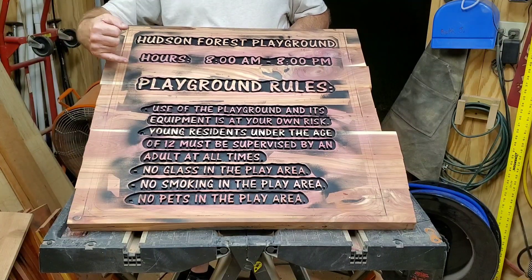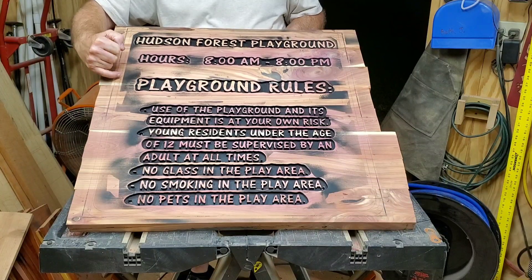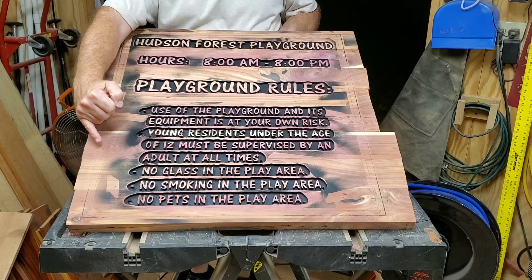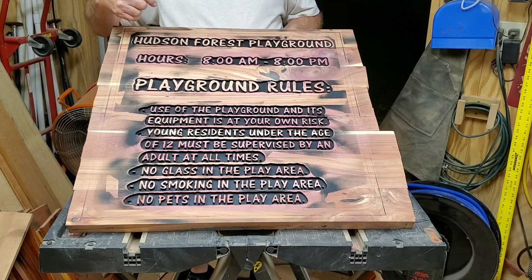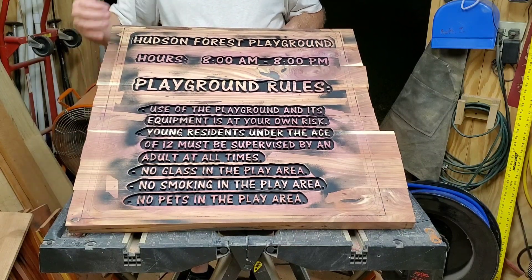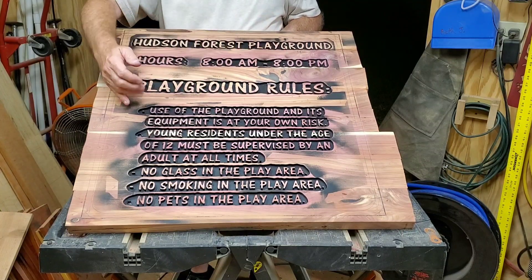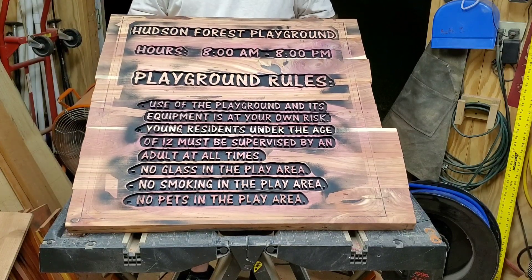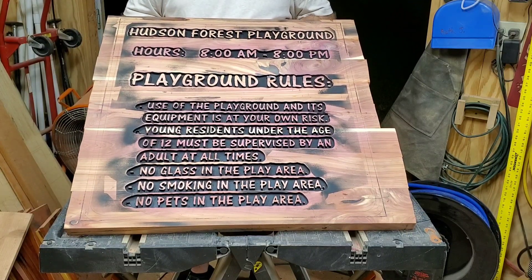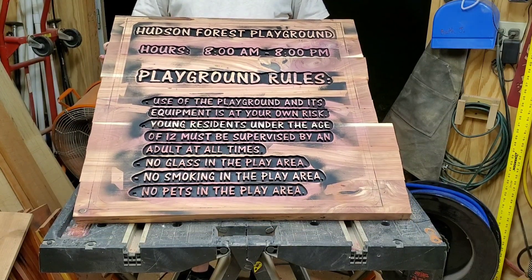Tomorrow afternoon I will start clearing out the background. What I'm going to do is come in along this inside line all the way around — I've got to cut about an eighth inch deep and about a quarter inch wide relief so that I can clear away from there, and then I've got to take about an eighth of an inch of all this material away before I can start the background I want to cut into. I've still got some carving to do, but it's going to move on pretty quick.